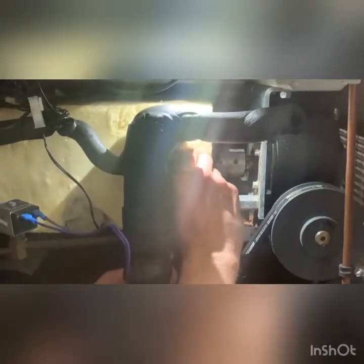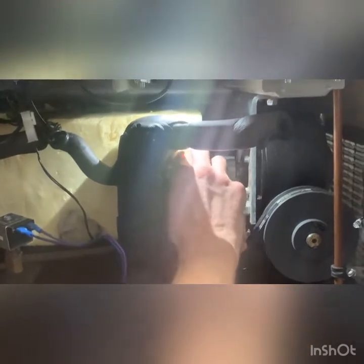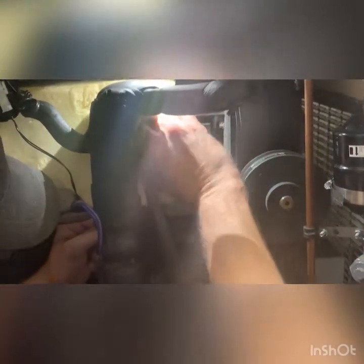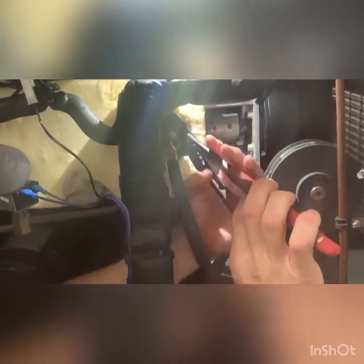Based on the fact that I can't see threads, there's an o-ring on this sensor — there we go. Okay, and now a new ring. The concept is not hard. I've had to change these every year because they've been terrible. The process isn't hard — it's just a nut — but now getting this to tighten without spinning the inner. I can still see my mark on the washer, so I've got my middle finger on that inner ring while I'm spinning the nut. You don't want to go crazy with this — there are o-rings holding everything, and if it's sealed, it seals.